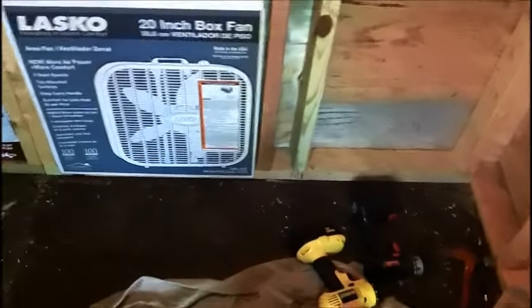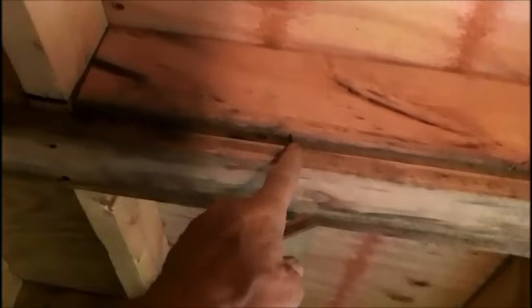Now what I've got to do is bring the plywood in and mark out for these 2x4s so that the plywood will shove right up against the wall. This will act as a support so I don't really need to put a cleat on the outside wall. Nothing's going to fall off the bench from the sides — only down there or off towards the front where I'm sitting. So this gives me a 22 inch bench instead of 24 wide, but that's alright. 22 is right here — there's the mark. That's my 22 inch, and that's plenty.